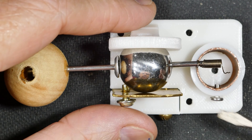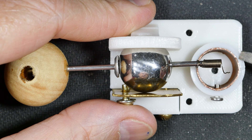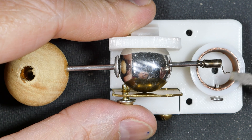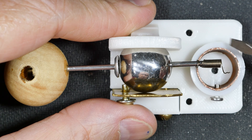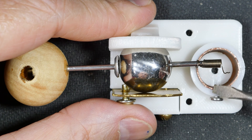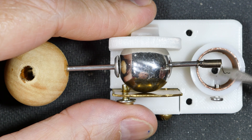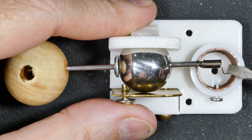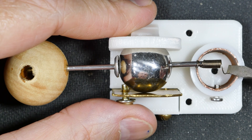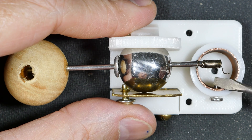The next change is much more significant: this copper pipe that I put inside here. I resized this so that a half-inch copper pipe would fit in here. The reason I did that is because I was using those two screws to touch the mineral, and they were just unreliable — the mineral would shift position even with a light touch of the cat whisker. The signal was going in and out, getting stronger and weaker. So I went back to the crystal radio bible — the Cub Scout handbook, whatever it is from 1960 or 1964 — and I looked to see how they did it, and they just used a piece of copper pipe.